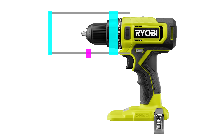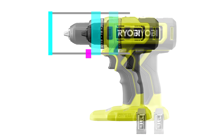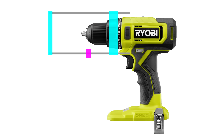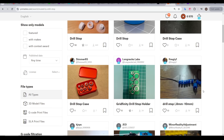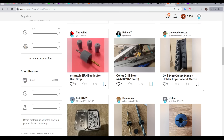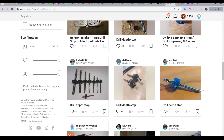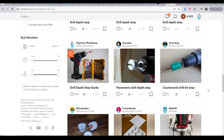And if we add an adjustable stopper to one of the guides, this should limit the travel of the drill, meaning we can do multiple partial holes or countersinking to the exact same depth. This seemed like a no-brainer, but I couldn't find anything like it in hardware stores or on places like Printables. Instead, the common solution is to attach a collar to each individual drill bit that hits the workpiece while spinning — not exactly what I was after. It seemed clear the only thing left to do was to just make it myself.